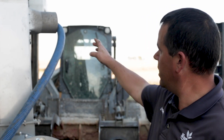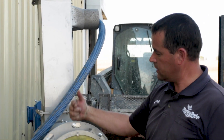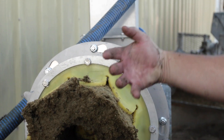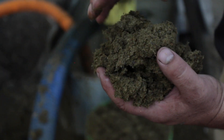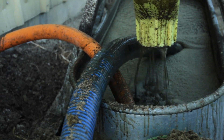This is the solid separation unit. We've got our dirty sludge going in the top. It goes down into this screw — essentially there's a large screw extruder in here. It's pushing the solid manure out the end into what's called a plug. This is our dry solid product, and then it's dropping the liquid into this tank. From the tank we're sucking this product into our micro filter, which is taking the additional solids out and getting the product clean enough to go through drip irrigation.